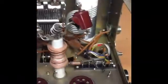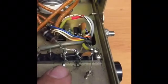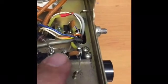Good afternoon everybody, Joe here K7JOE, and I'm working on a Kenwood TS-520S. The symptom of the 520S was low power output — only two or three watts — and I wasn't getting any indication on the RF meter. We're going to explore the repair. Looking inside the final case, I've removed the fan for easy access, removed the chassis cover, and the two 6146B tubes. I noticed on this strip there was a resistor and a diode that had blown.